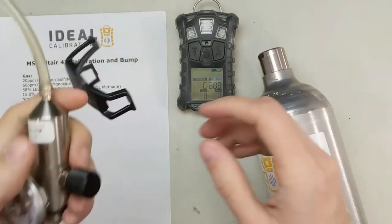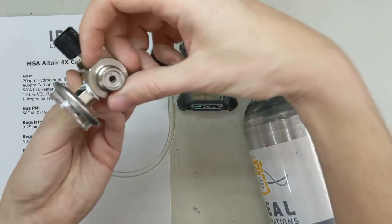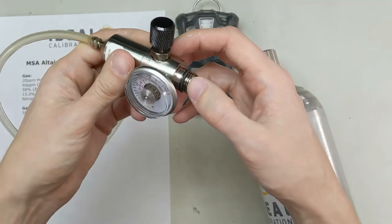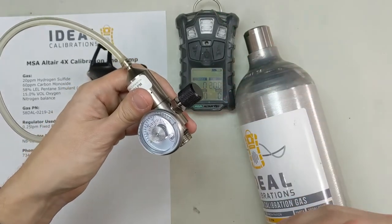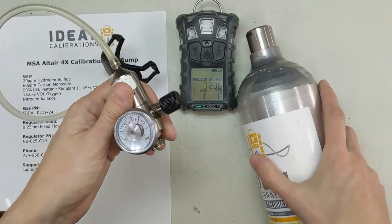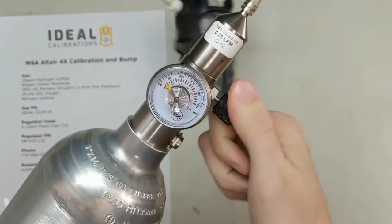Here's what we're going to do: take the regulator and unscrew it. This is an important step — you need to open the space here. When you open this valve, if you look down in here you can see there's a hole. If this is closed off and there's room air moisture or condensation inside, when you screw it into the cylinder you're creating one enclosed space. That moisture can go back into your cylinder and start to degrade your H2S. So you want to make sure you open this so it blows the moisture out. Then go ahead and screw it in and just wait for it to pop and start spewing gas a little bit, then close off your valve.